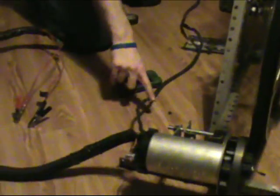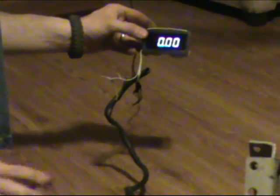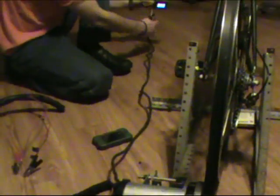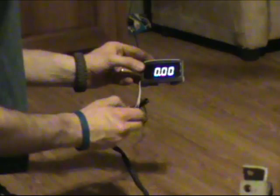Now off of the other end of our 3-way that we tied together, I came out here to a voltmeter. The voltmeter I have right now needs an external power source. They sell those on eBay that do not require an external power source. It's powered by whatever you're doing. So for instance, just pretend these 2 wires from the wall right now aren't even connected to this. If you buy the one off eBay, it'll just run straight to this, and the 12 volt power source will be whatever you're pedaling. Okay, with that said, let's send this thing a pedaling.